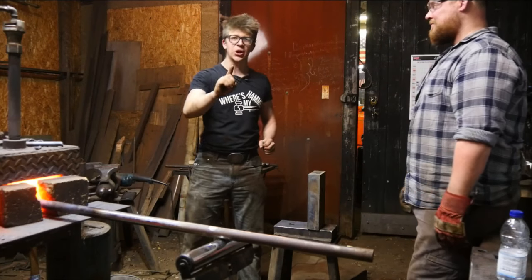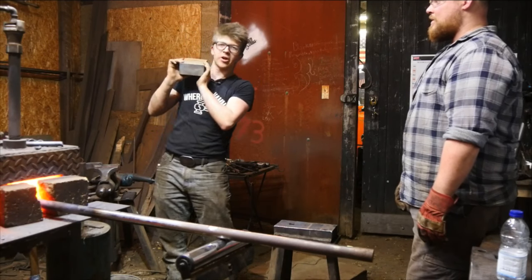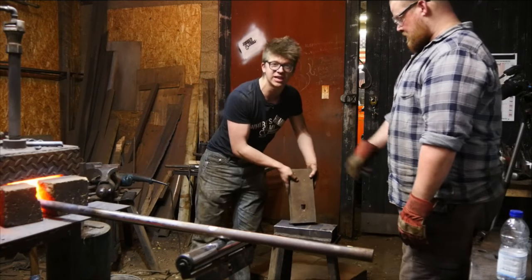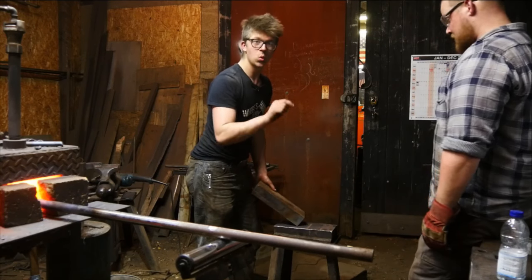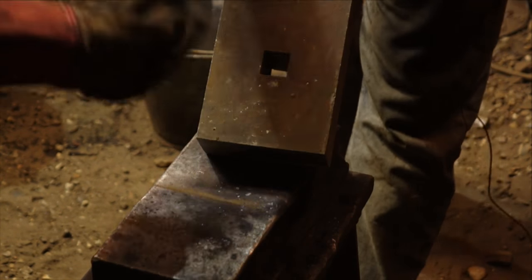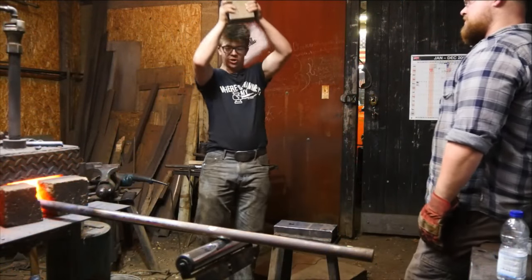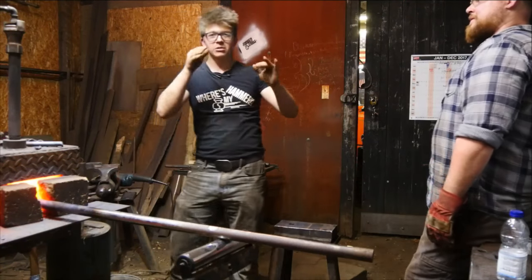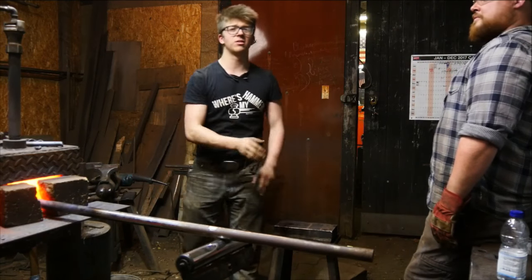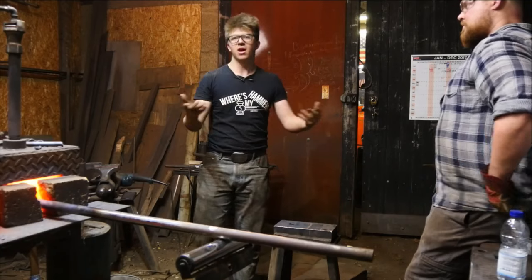So the reason that we're doing this show today is because I have 9 of these pre-cut striking anvils ready to go. They've been flame cut on the profile, and it's an incredible job that they do flame cutting that profile. Then we send them off to a water jet cutter to get a really nice square hole in there. Thank you very much, Nick, for your wonderful demonstration. So, we have these, and they're pre-done, they're ready to go. All you gotta do is throw them on a stand, put a little radius on the edges, a little bit of sandpaper in the hardy hole. Exactly, and there's a video on my YouTube channel that explains how the stand all works, the angles you want, the type of tube you want, the height that you want, etc.